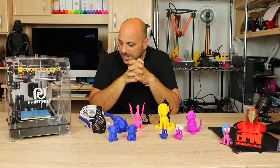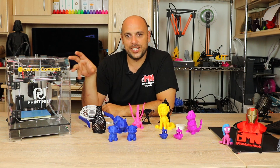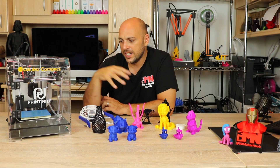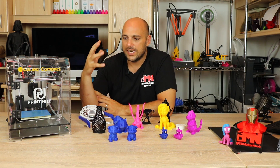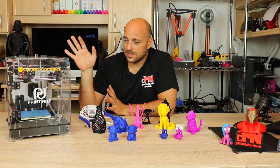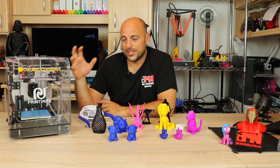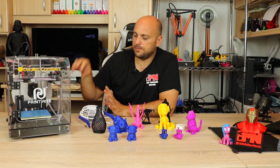So what do I like about this printer? I love the way it's enclosed in clear acrylic. Being aimed at a younger generation, I think they got it right — this is the perfect setup for a printer that has to be used by a younger generation. The build volume is acceptable at 130x130x130mm, good enough to experiment on. In terms of frame, it's actually quite sturdy. Even though it is acrylic, it's very thick — about seven millimeters — making for a very sturdy frame. Everything is glued together really nicely so you don't have screws blocking the view.